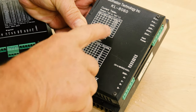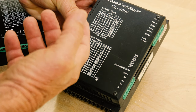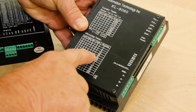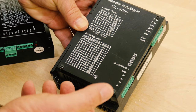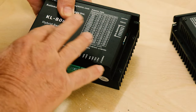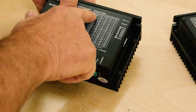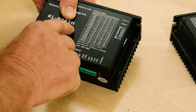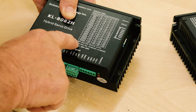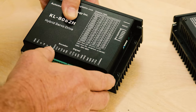On the original driver there are eight DIP switches. The first four switches determine how many amps there are according to the stepper motor's rating. The next four switches are based on the number of micro-steps you want per revolution. My new driver only has six switches — there's no way to set this for the amperage rating of the motor. The first four switches are just for the number of pulses per revolution; the default was 1600 and that's what I left it at. Switch five is for motor direction and switch six is for the motor type.